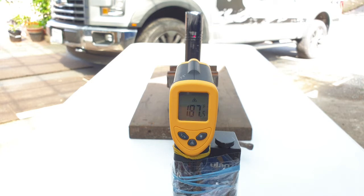I did take the light engine out of the light to make some connection tweaks so we can get a bit more current draw — to push out the absolute max output possible. That's how we reached 4000 lumen. With the same Manker protected battery I was able to get another 250 lumen, so we went from 2650 to 2900 lumen with the older Manker protected cell.